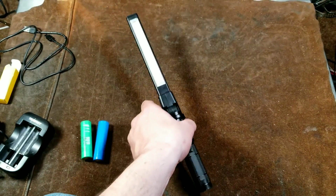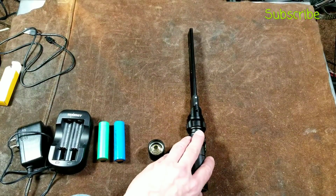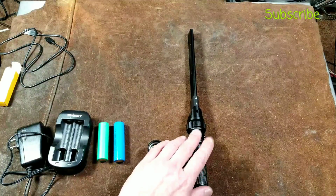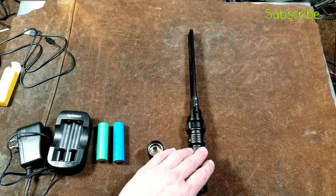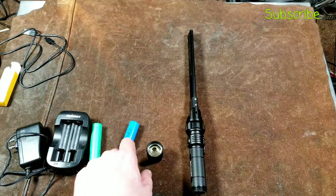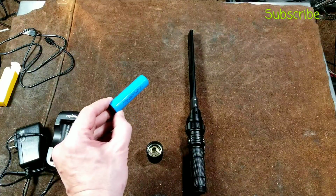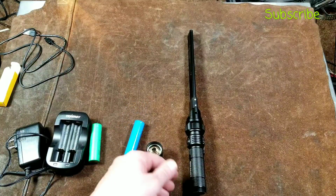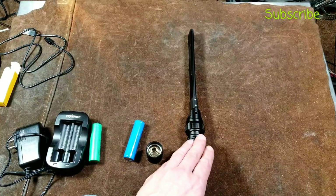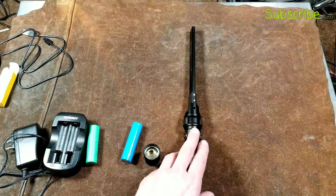And on a final note, I would recommend, if you do have multiple batteries, this has a pretty low power. It's like a 500 milliamp charger or something in it. Excuse me, it may be 1 amp because it advertises a 4-hour charge time on a 2200 milliamp hour battery. That would just be false advertising if it said 4 hours, although they may just be rating it at 2 amp hours with a half amp charger. Still, there's losses. I haven't measured the amount of current that it uses, but it's going to be somewhere between half and 1 full amp.